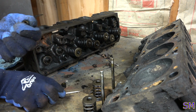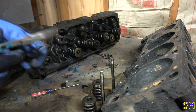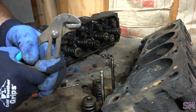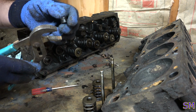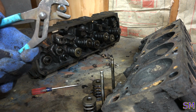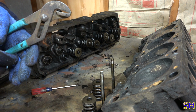There's not much for pliability here. Let's see if we can break one. Because you like being destructive! That's what a no good valve stem seal is. So a lot of the ash you guys saw on those pistons, this is at least part of the culprit. Let's do that again. This one's on the other side of the valve. Yeah, valve stem seals are not supposed to do that.